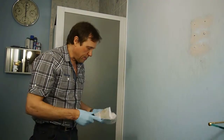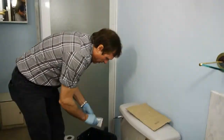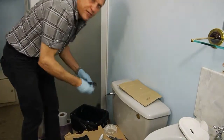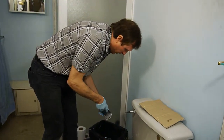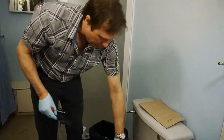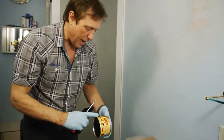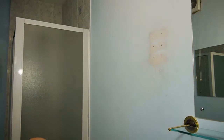The item's gone off now and we've finished that stage. So what we do is we can just see it easily comes away from the lid. Now of course, if you left that a little bit longer it wouldn't quite be as easy to remove. But whilst it's what we call green it's very easy to remove. The advantage of using the hybrid filler is that it's got good adhesive properties — it's got epoxy resin in it — and we can drill it and the material won't break away. It drills very, very comfortably.